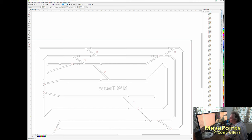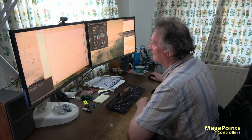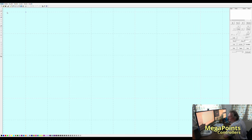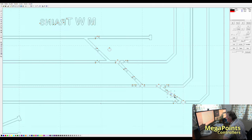Okay. To fit, Control A, file, save as. And let's save that again as the DXF, and that's fascia. Yes, overwrite. Okay, come back to this. I better stop recording. Now we're recording on LaserCut, so let's get rid of the old one. File, import, fascia, join lines, check data. I need this to say zero or have all. Check result two. So the two things it doesn't like that. It's here. Didn't see that. Blimey. Just that one there. How annoying. Okay. Let's go back to the other drawing and fix that.